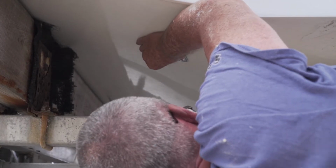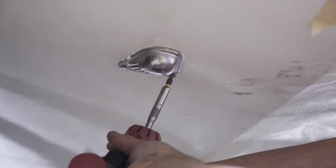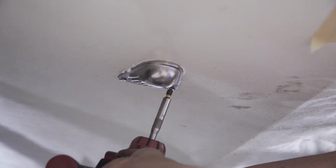He wanted separate pickups on each one of these live wells. You want to get the correct hole size for the threaded pipe that's going through the boat, because you want a good tight fit. You don't want water coming into your boat other than going into your live well. So I'm going to get a correct size, high-speed pickup. These are designed to flow water to your live well while you're up and running without a pump. Got these all sealed up, installed.